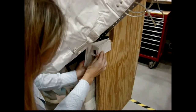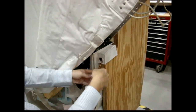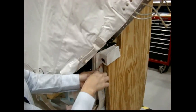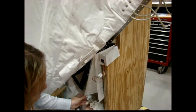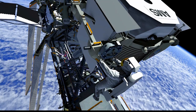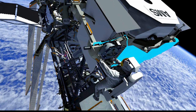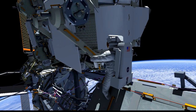Here is how we're sliding it over the main radiator, and then we're securing it with a wire tie to tie it down. Once secured, the MLI will pop out like a small tent, filling the wedge in between the two radiators to protect them. Once we're there, Chell's going to work back to put on the big blanket. This is point A, the first tie-down he does. It's not going to happen that quick on orbit — we're going to have to go down to a second strap, put that strap around AMS, and then work to a third and a fourth strap.